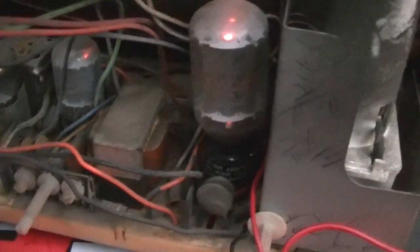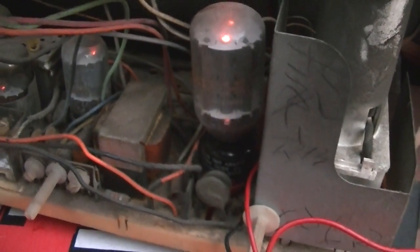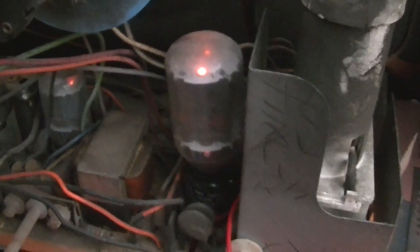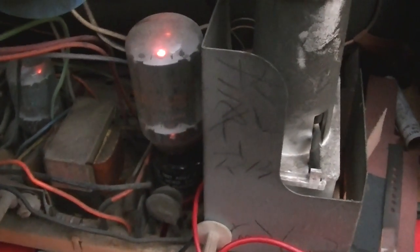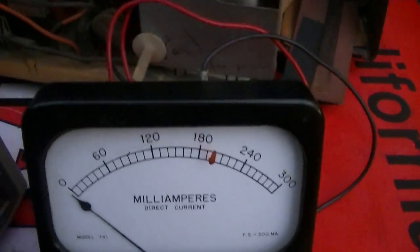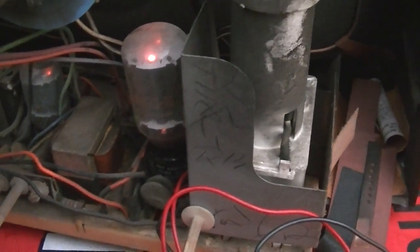Okay, this is the cathode current test adapter for the 6JS6, a Zenith color tube. But it gives us the plate on the 38 and 33G and H series. So let's see what we get here. The plate on the damper. So this will tell us how much current the horizontal circuit is drawing.